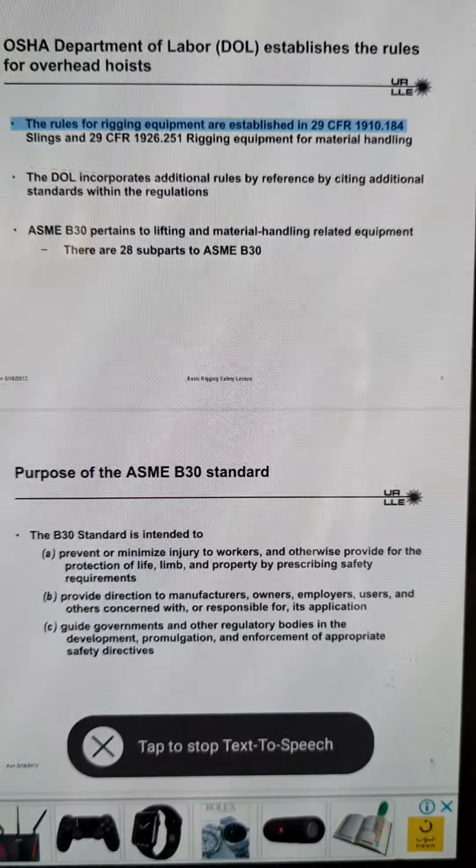Lecture 30. Hoist ring load rating and torque values are stamped or etched on the ring, located on top of the hoist ring. A torque wrench must always be used for installation. Never exceed the load rating.